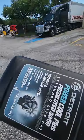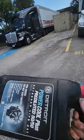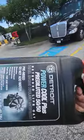One part of the component, I know you always hear about overheating, a weep hole leak in the water pump, and driving while it's hot. Well, I don't have that problem. My problem is that the radiator hasn't been flushed out since the dinosaur ages, and there's just brown fluid. Bear with me as I do another last round of water. I'm gonna put a gallon in there, and it should start to clear up before I put the antifreeze. But this is the third time I'm flushing.